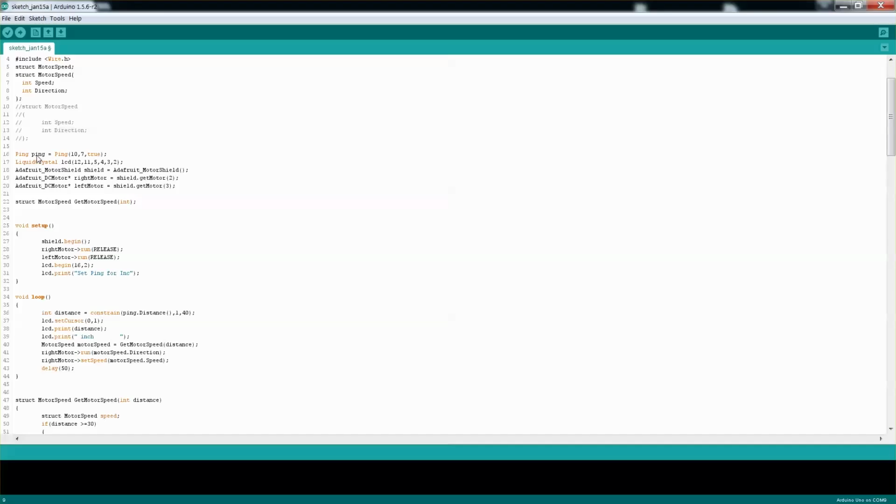Initially we're using 1 ping right now, but obviously as we get closer to the end, which will be next video, we'll have 2 pings. The first ping is going to use 10 and 7. It's the trigger and the echo, and then if we want inches or centimeters. The typical liquid crystal, nothing to explain there. And then I'm creating a shield object, and therefore after that getting 2 more motors that are actually motor 2 and 3 on the Adafruit motor shield.